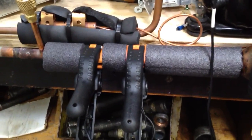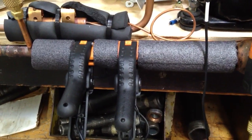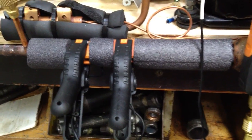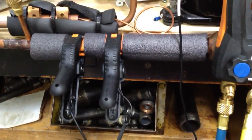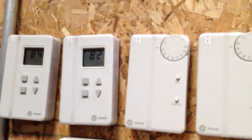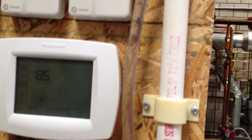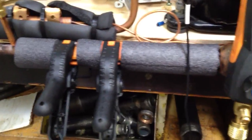I insulated this saturated liquid line, so I have very minimal influence from ambient temperature. It's not that warm here — there's a thermometer sitting here and it's maybe 82 degrees or so. I discharged air from the condenser right against that wall, so it may be close to 78 degrees in the shop. So we have very minimal influence from these clamps.